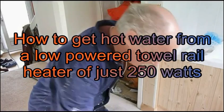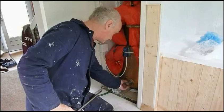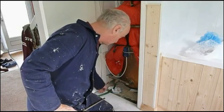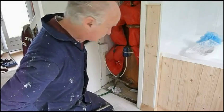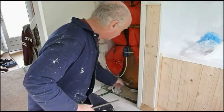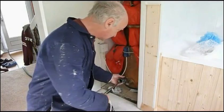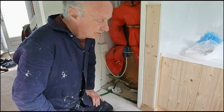This is the stage where we're going to fit this element into this tank — it's going to go into this feed here. I'm going to drain this cylinder out of the hose outside, turn the valve off first, drain it out, and we're going to disconnect this and using this T-piece we're going to push this all in and make it fit.